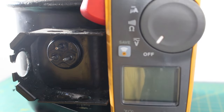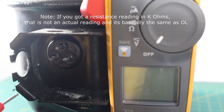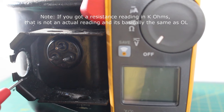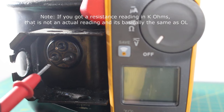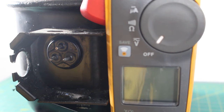Let's go over what actually happened here. Between common and run, we had 1.2 ohms. Between common and start, we had 6.1 ohms. If you add those two values together, we have 7.3 ohms — so the value of these two readings should be the value of the reading between start and run. Between start and run, we actually got 7.3, then it went down to 7.2 and 7 ohms. So it's very close, and I can determine that is a good compressor. You're not going to get perfect numbers — this is not a perfect world.